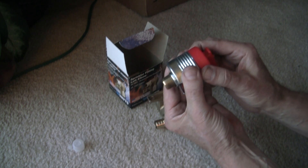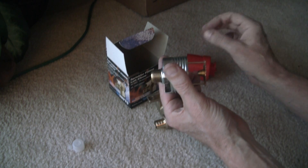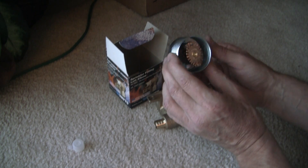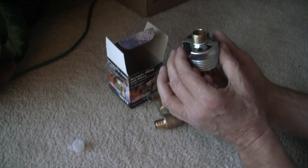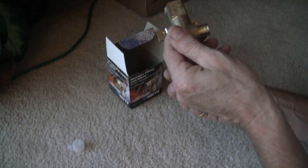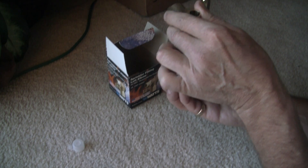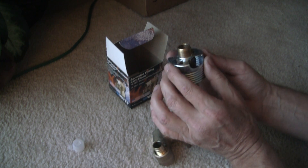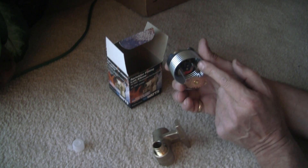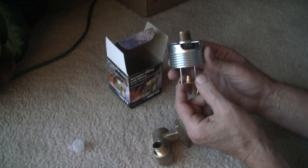This plastic cover is just protection for the sprinkler head itself. It's going to be removed when you do the final installation, and you need a special wrench to get into the inside of the sprinkler head and twist it so that it's a watertight fitting onto the Watts fitting. When you install it, you should be careful about damaging any of the parts inside, because it's basically a bulb that bursts at 165 degrees, and the water gets deflected down onto the deflector and spreads throughout the room.